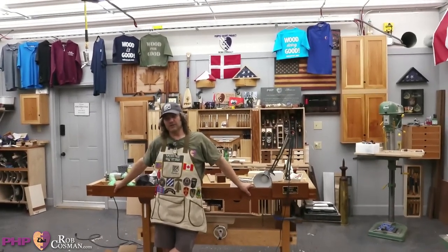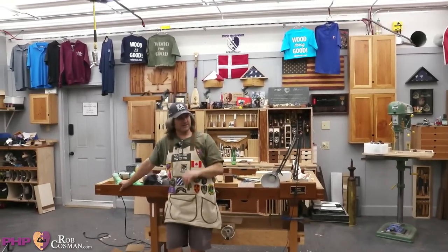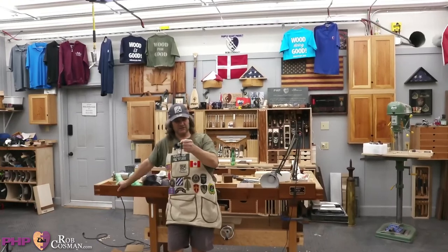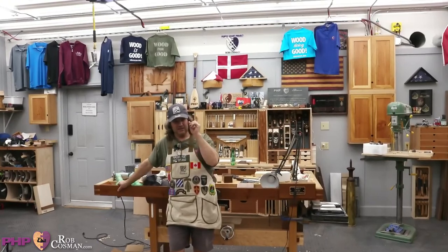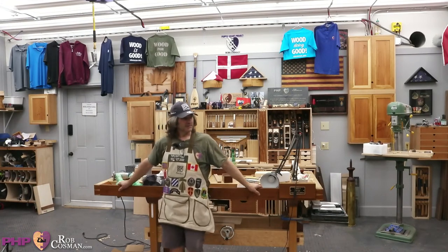And people say, well, I don't need it to be that accurate. Well, you know what? You want your holes to be exact. It's bad enough that the drill will flex somewhat, but when your quill will move, well, you're kind of asking for trouble.